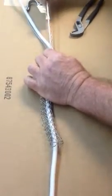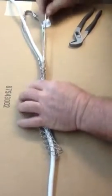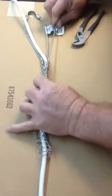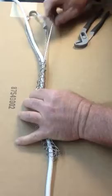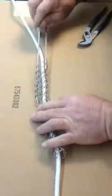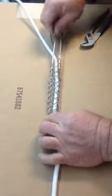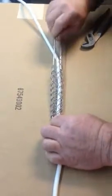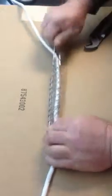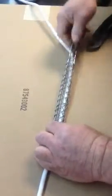And as you're putting your pin in, you sort of twist and push at the same time, making sure you catch both sides of the grip. Push down on it too as you go. So push down extremely hard as you push through, and if you twist, you will notice it sort of links in and catches each side of the cable. But make sure you do catch both sides as you go through. It's a little hard, but it can be done.